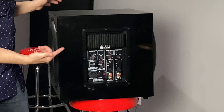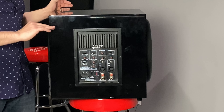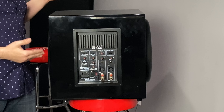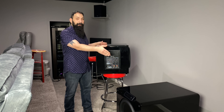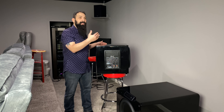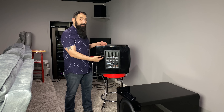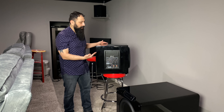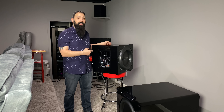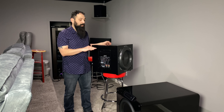This is controlled by this 600-watt Class J amplifier right here, which is different than most subwoofer amplifiers. Typically if you're buying a subwoofer like this SVS over here, that one's Class D. And usually stereo speakers use Class A or Class AB. But this one uses Class J, which is probably the most notable thing that separates this one from the rest. The amount of output you get from this 600 watts doesn't equal the output I've heard from almost any other subwoofer at 600 watts.